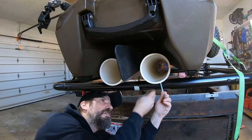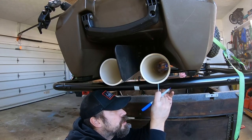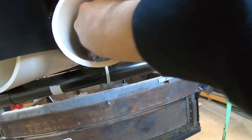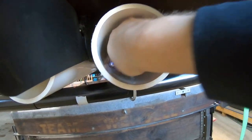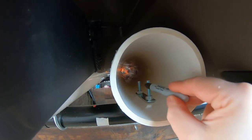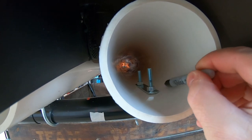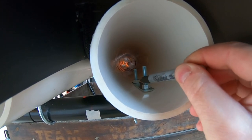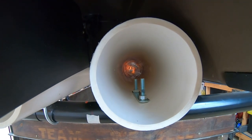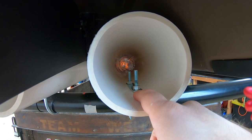I'm making marks on the bottom of my PVC tube where I'm going to drill the holes. I put the U-bolt in there and put the nuts in. Before I tighten them down, I realized I can't get my socket in because the stems on the U-bolt are too long — so I'm going to have to cut those off. You can cut them with a hacksaw, grinder, or sawzall. Cutting them down will let me get a shallow socket over top to actually tighten them down.